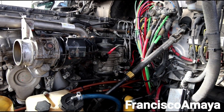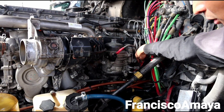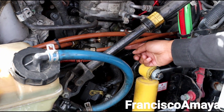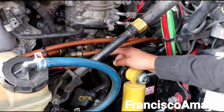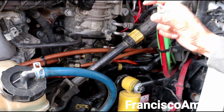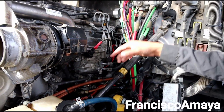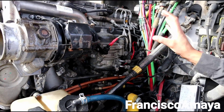If you don't want to buy the kit, all you have to do is extend the wiring yourself. I did this wiring and the other wiring over here to the other sensor. The water-in-fuel sensor goes below — on the three-stage the sensor goes right here and the plug is completely different, so we have to modify that. We also need to buy an adapter for the doser block because the doser block is completely different. And that's pretty much it on this side; this side doesn't require that much work.